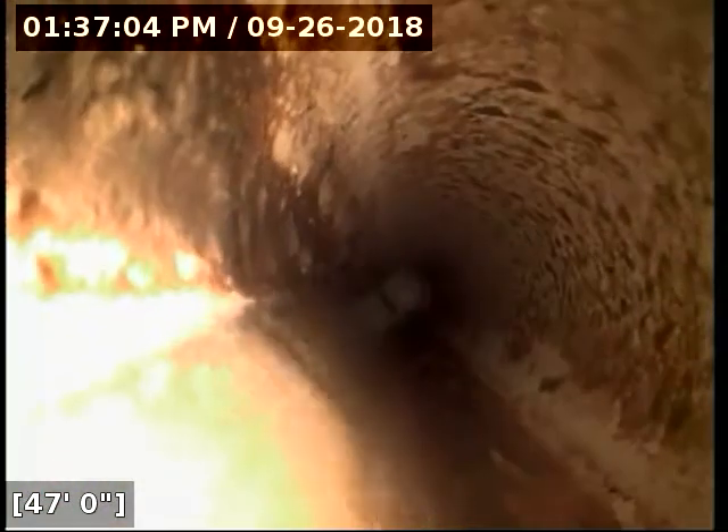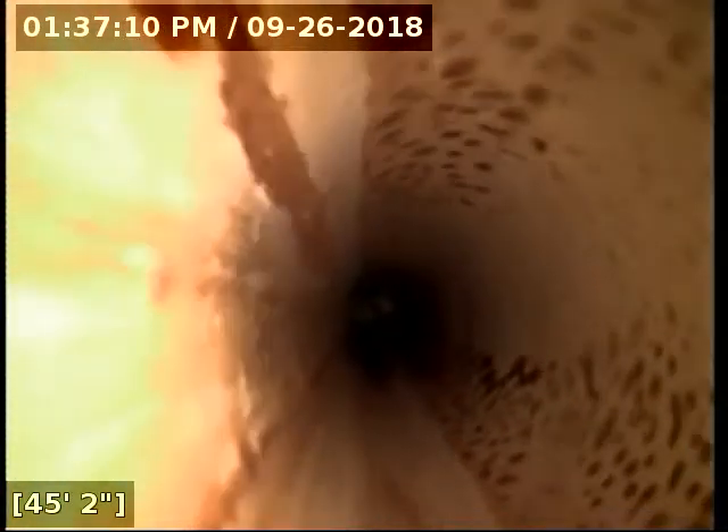All right, our belly here in total, for the most part, it extends from 47 feet to 50 feet. It's about a three-foot section of pipe here. And at its deepest point, right in the middle of it, the water line is coming up halfway up the lens. We've got a half-inch of standing water here. Typically, I won't see any toilet paper collect until you have at least five feet of pipe and at least an inch of water, not unless you're putting stuff down the line that shouldn't be going down there. For that reason, I'm not going to recommend any repair on the line. Just make sure you're not putting grease and paper towels and all kinds of stuff like that down the line.